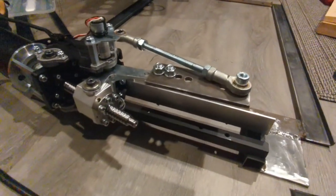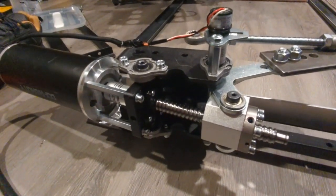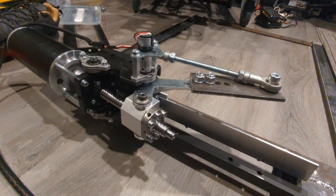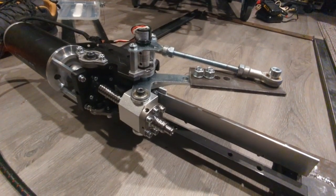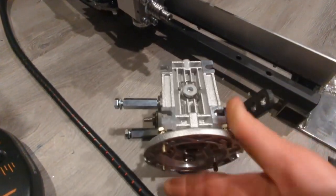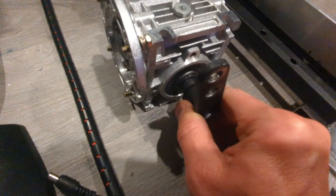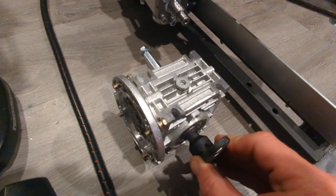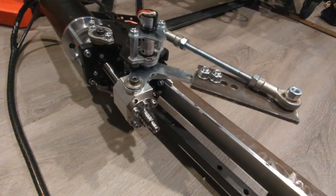Okay, so here's where I'm at now. I had to wait about a month, but I ordered an SFU upgrade kit for the motor because although the surge platform worked pretty well, the issue I was having was with the gear lash, just like anybody who has the old gearboxes understands. And here's an old gearbox here. The problem is that you've got a little bit of slop in these gearboxes. So what was happening is the platform would surge forward, and then it would get this slop at the end, and you'd get a lurch, and it was very immersion breaking.